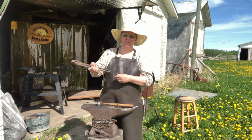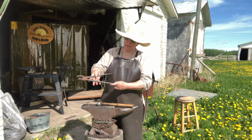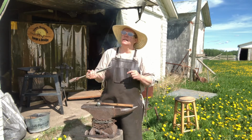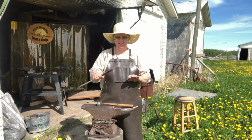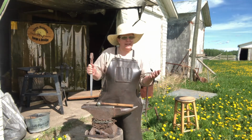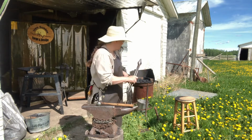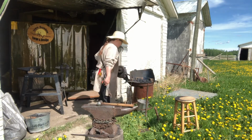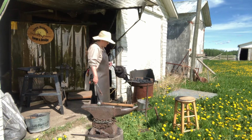Right-handed tongs, this is a pair right here, as you can see, they fall down this way, so I have a chance of pinching my skin. That's not a fun thing to do. You get used to correcting that. You can modify, pull these in a little bit more. But if you want to make the tongs for the right hand, or the correct hand, you'll have the ability to do that. There we go.